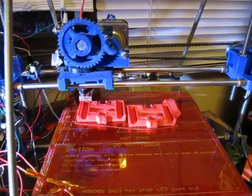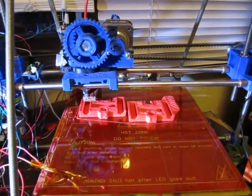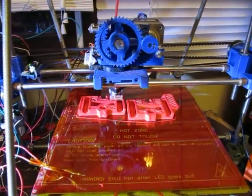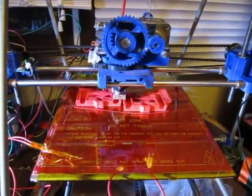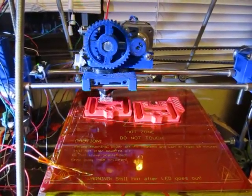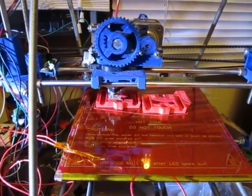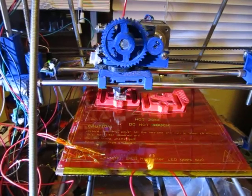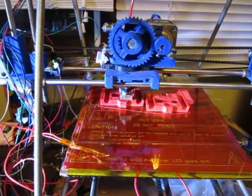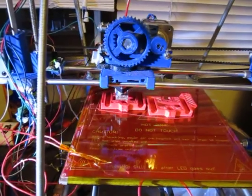This print is actually going pretty well. It's hard to see in the video, but things are looking very close to where I need to be. I fixed some issues in the hot end while I'm at it, and I fixed some issues with my belt — that was an offset of the 608 bearing on one side versus the 608 bearing on the other side. They weren't perfectly lined up, so when I got to the end of the Y axis the belt was falling off. Now that everything is fixed, this printer is doing a lot better. I'm pretty happy.